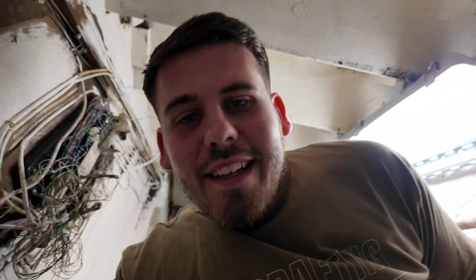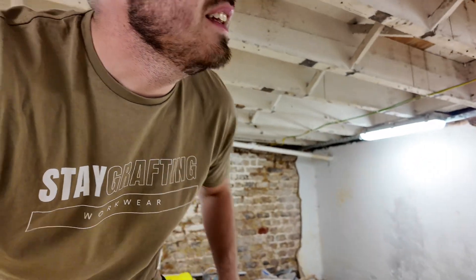Now we're going to jump inside and have a look. I like doing these because you don't know what to expect - I've literally just been told to press the buzzer for first and second floor communal. This is the basement area where the main feed comes in for the communal area. It's full of cobwebs, but there's not too much going on down here - a bit of tray, a few lights, some earthing and earth bonding. Nothing major to worry about.